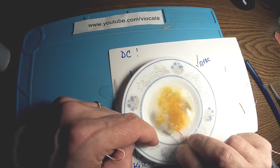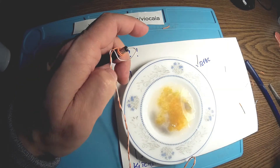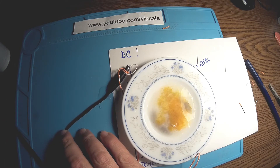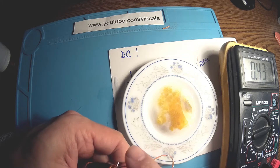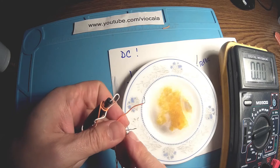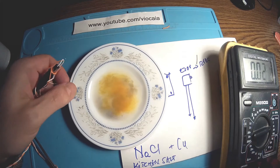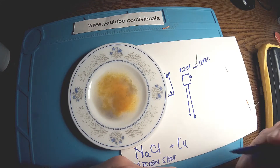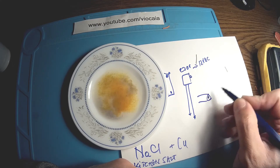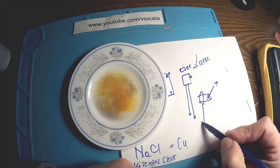The darkest one is the plus — that's for sure. Let me check with the multimeter now. Yes, it's very clear: the white one is plus. So in this connector, the middle pin is plus and the external one goes to minus.